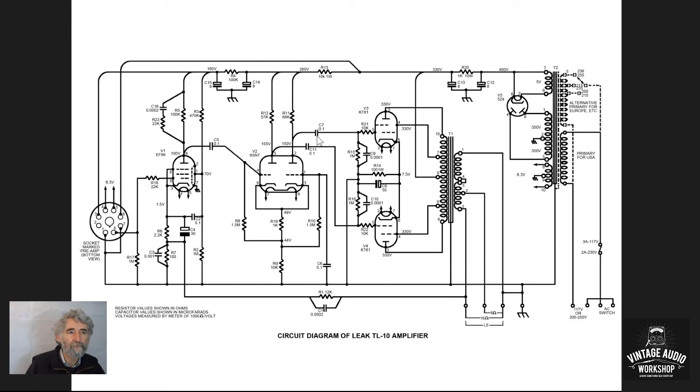It was probably very reliable as well. You'll notice plenty of decoupling — a resistor, electrolytic, then a large resistor and another electrolytic to decouple the input stage. And where the HT is taken off for the preamp there will be plenty more decoupling, but we'll come to the preamp next.